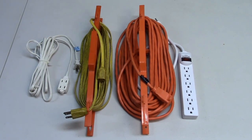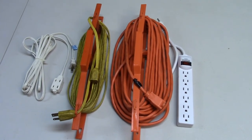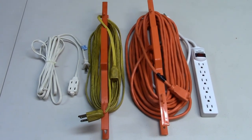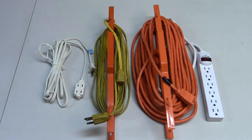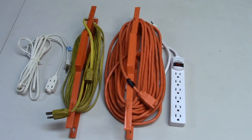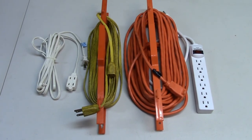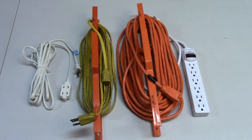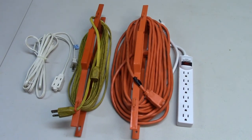More power. I want to go a little deeper into the subject of power cords. Here you see a typical white household extension cord that you might use with a lamp or a clock — this will never provide you with enough current to run most of your power tools without doing damage to them. The yellow cord is a much better option, though I'm guessing it is of a lesser gauge than needed for most power tools. The orange extension cord is much heavier duty. I strongly recommend that you get a 12-gauge cord for all of your power tools. When you first start up the motor on a power tool, it draws a larger amount of current — perhaps more than when it's up to speed. If your power cord is of a lesser gauge, this puts an unnecessary strain on the motor during startup because it can't provide enough current.